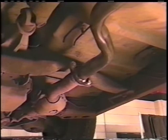Remember, like I said before, keep your wire mostly pointed towards your flange, because that's the thicker of the metals. We're going around in a circle and moving our way down and around the pipe to concentrate that heat so we make a very nice weld, a factory finish. And now that we're done with the weld, we're able to snug those bolts up, because now it's a fixture.